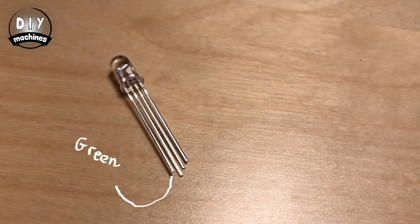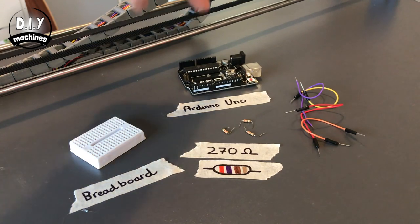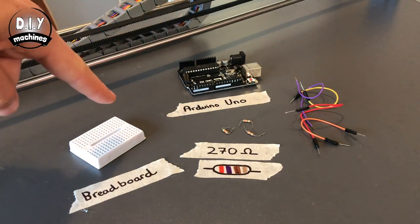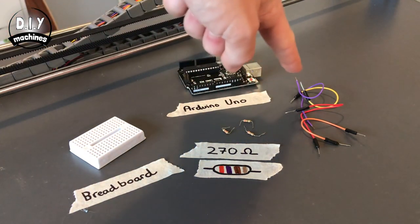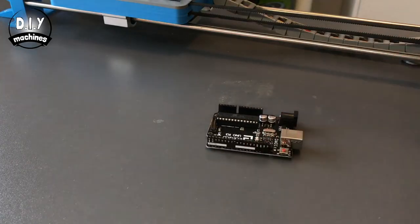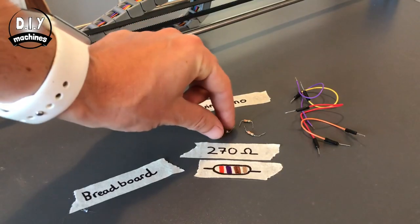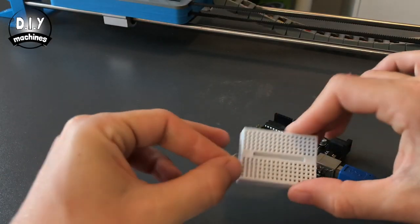Our LED has four legs on it, to which we have soldered four different colored wires. We'll work out now which wire is connected to what. To do that, we'll want our Arduino Uno, a small breadboard, three 270 ohm resistors, and four short wires. If you prefer them, you'll find links to circuit diagrams in the description below.